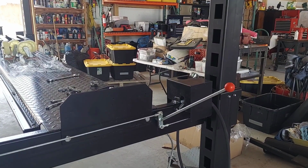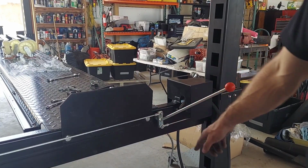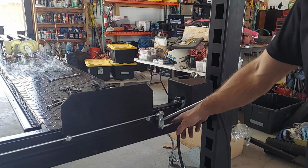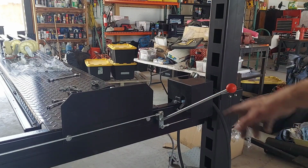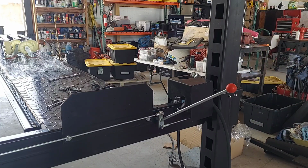Now you're going to go back underneath and tighten the lock nut that's at the end of this rod on both sides. And once in a while on these FP11s, if you don't get all this tight and everything, it won't twist enough to release all the locks. So sometimes you have to go underneath there and twist that black tube the opposite direction, kind of preload it. Will give you a little bit more twist in all your locking system.